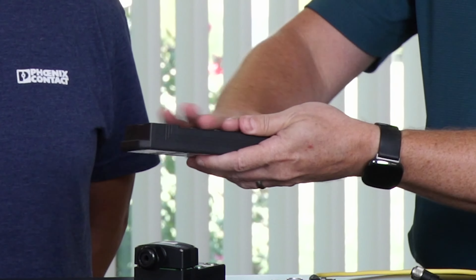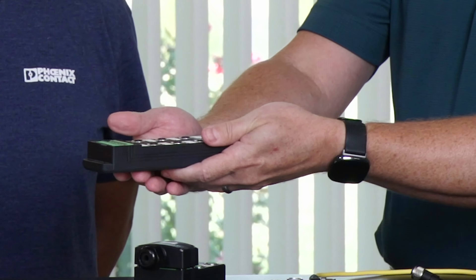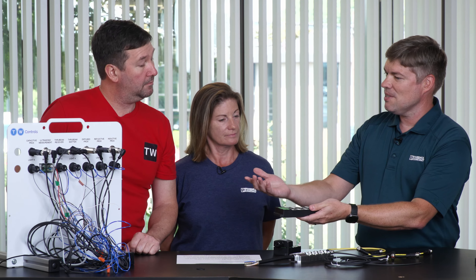There's a lot of brown, black, and blue coming in, and you've already got the M12s. One of the things we could talk about is molded M12 cable — it can make it plug-and-play by collecting all of those signals. To your point about the power wiring, the way the PCB inside this box is wired, you've got common power to all your slots.